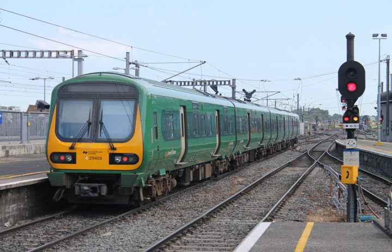Such advantages must be weighed against the underfloor noise and vibration that may be an issue with this type of train. Generally diesel traction has several downsides compared to electric traction, namely higher fuel costs, more noise and exhaust, as well as worse acceleration and top speed performance. The power-to-weight ratio also tends to be worse. DMUs have further disadvantages compared to diesel locomotives in that they cannot be swapped out when passing onto an electrified line, necessitating either passengers to change trains or diesel operation on electrified lines. Similarly, the lost investment once electrification reduces the demand for diesel rolling stock is higher than with locomotive-hauled trains, where only the locomotive has to be replaced.